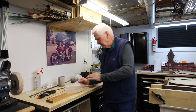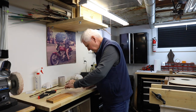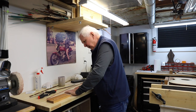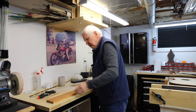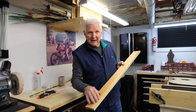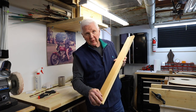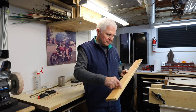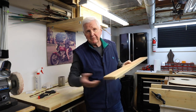We get some wax paper and we get our binding without any purfling on it and we simply slip it down into here. The wax paper goes into this trough, and I should point out that this trough is nothing more than a piece of pine — it's a 1x4 that I've run over the table saw in order to cut a little kerf in here. Now if you don't have a table saw you might have a skill saw — just get this secured, run your skill saw at a certain depth, run it along here and you'll end up with the trough.